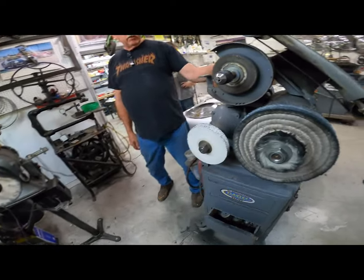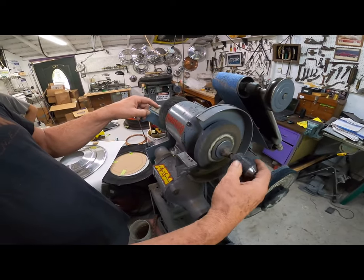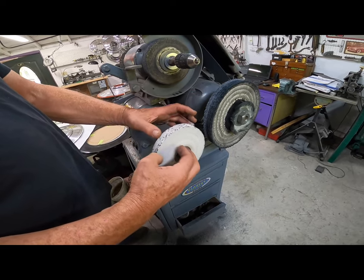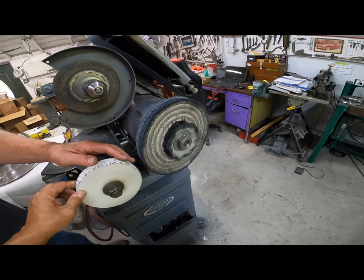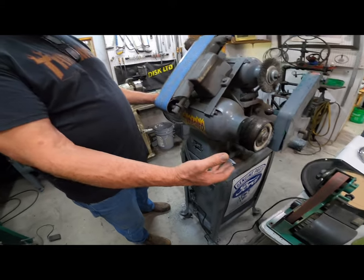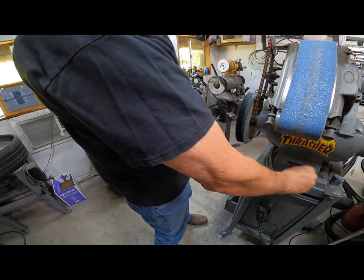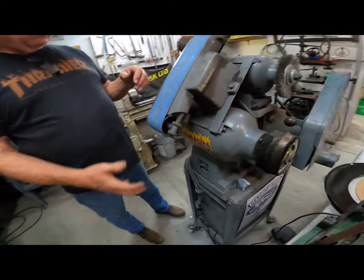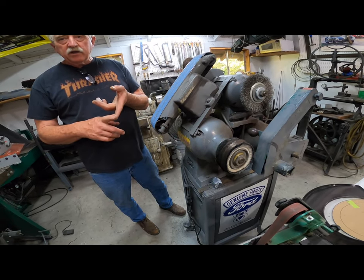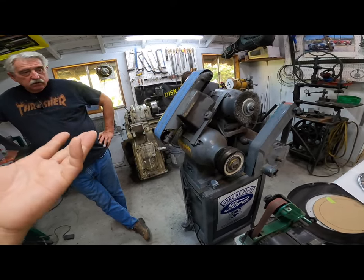This is the do-all machine. We've stacked a bunch of grinders on top of each other and can grind anything — there's a wire brush for cleaning, belt-type attachments that can get into corners, a silicon carbide wheel that's really good for sharpening lathe tools, and a couple of buffing wheels. These multi-piece belts are amazing — they never fail. We stand behind this machine more often than any other because everything needs to be cleaned, trued, paralleled, and flushed, and this does 90% of that. It's three motors all wired together.